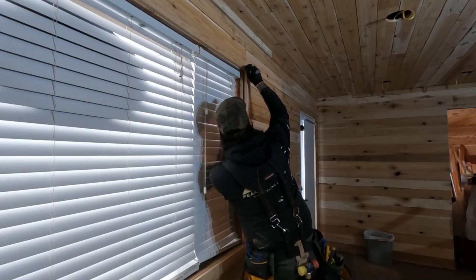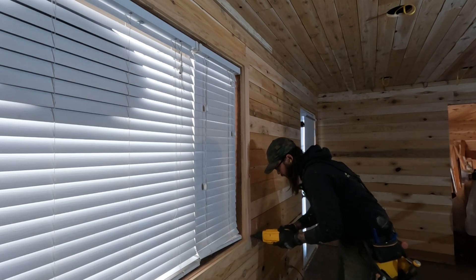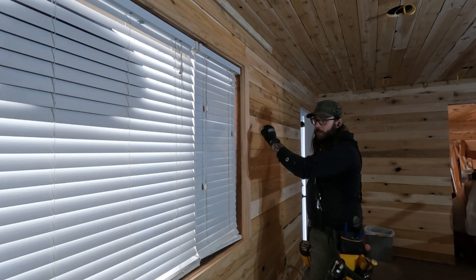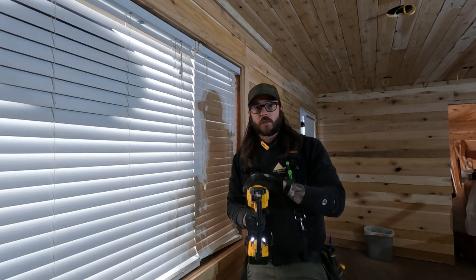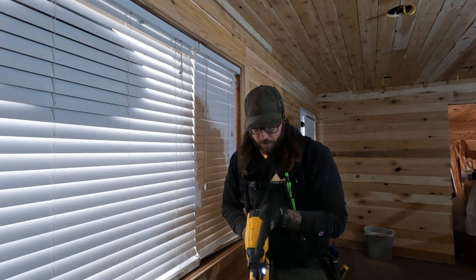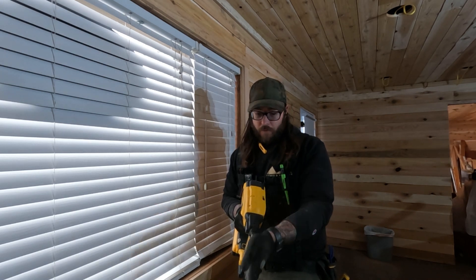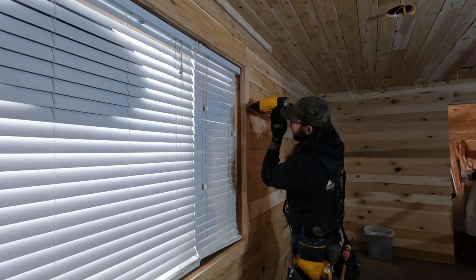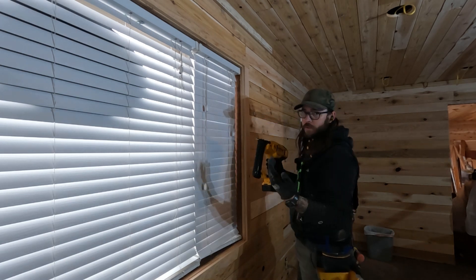Now all we have left is this last side — that's a nice tight fit. You have framing around your window with studs going all the way around, so when you nail all this trim off you're going into the jamb extension and into the rough framing and that'll hold it nice and tight. You might notice the orientation of the nail gun itself. Brad nails have a chiseled end that comes to a point, so when it comes out of the gun it can only deflect side to side. Unless you hit a knot or a squirrely piece of grain it will very rarely deflect up or down. So if you orient your nail gun to the side, you know that if the nail deflects it's going to drive down or up into the piece. If I were to nail with it rotated, I run the risk of it deflecting and coming out the side of the jamb extension — and then you've got a mess on your hands.